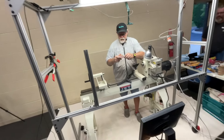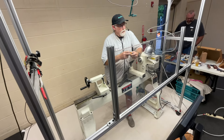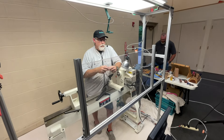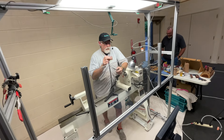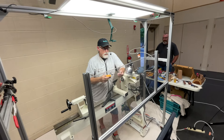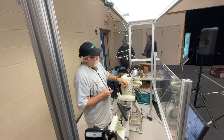Why do I use inserts instead of tapping a hole in the wood? I'm not very experienced in tapping wood or metals, I don't own taps and dies. Also, hardwoods and exotic woods might do well, but laminated layers with softer woods — not so much. So I think the mandrel with the insert is the better approach. You could put this into a chuck, but I'd like to get the full use of the whole piece, and you'll see why when I turn the mushroom.